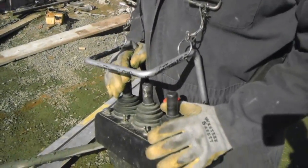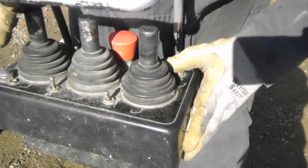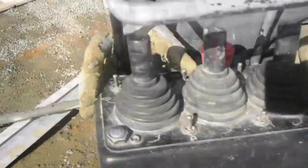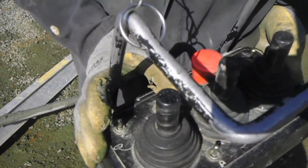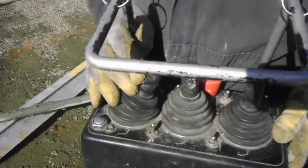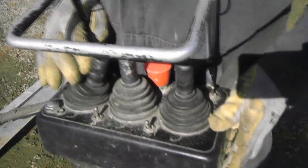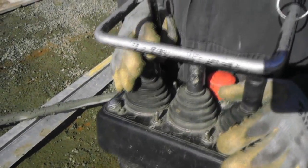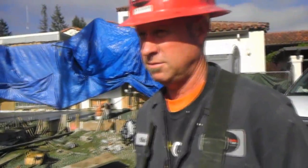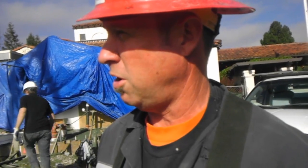Right now I don't have to worry about the second section too much, I'm just going to go straight up and down. So anyways, this is my RPM. And then I've got volume — if I push it in, it's going to go faster, controlling the speed of flow of the concrete. And if I bring it back, it'll slow it down. It can really go fast. I think the pump's rated at — I think it'll pump four yards in a minute.